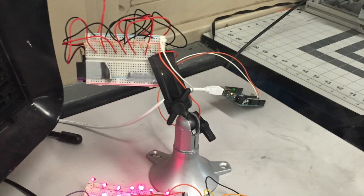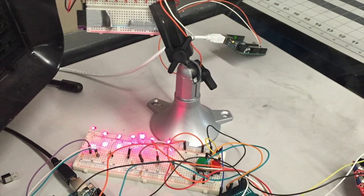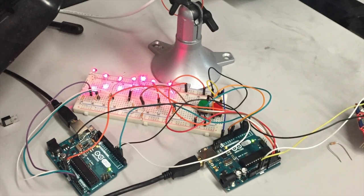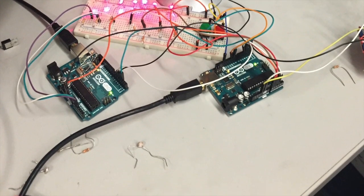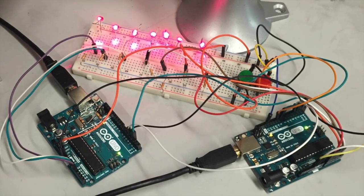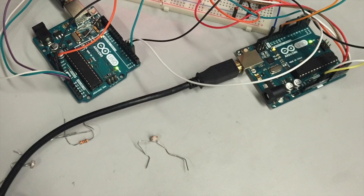Aspect of the laser harp. To build a laser harp, we use 7 different laser pointers, one to represent each note, and under it is a breadboard with 7 different photoresistors that the laser pointers are pointed at. To control the inputs from it, we use 2 separate Arduinos because each Arduino only has 6 analog inputs, so we needed 2, and we wired one as a master Arduino and a slave Arduino so that they can incorporate the 7 different strings.